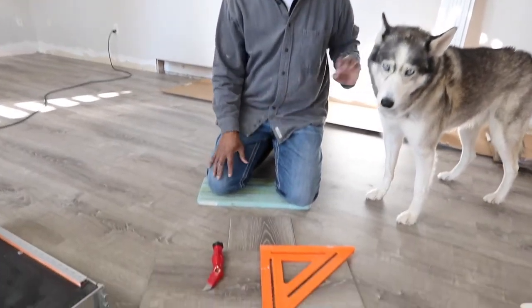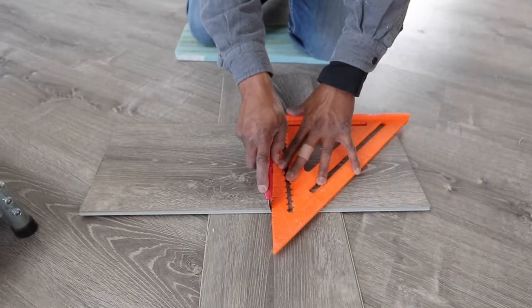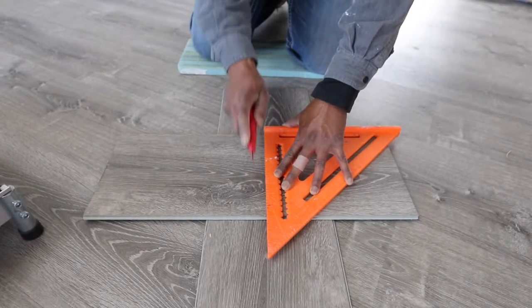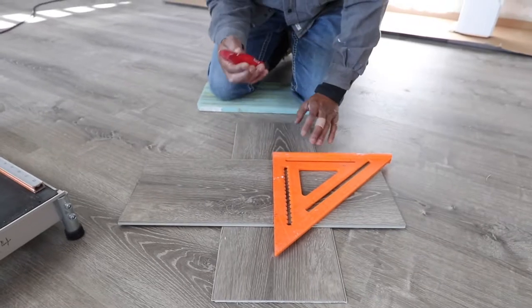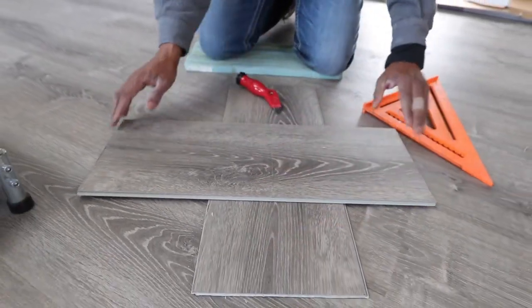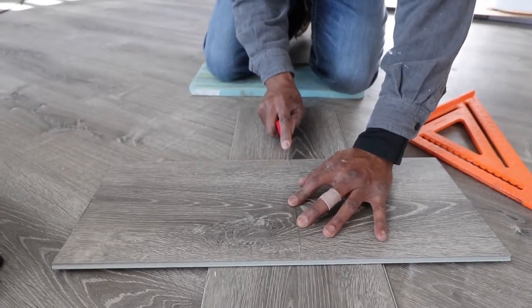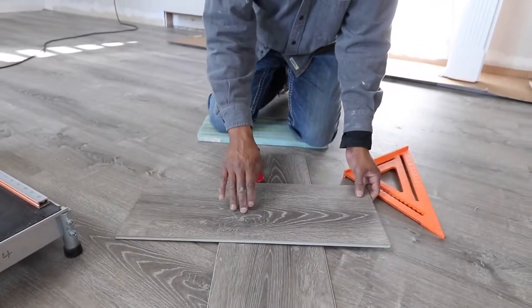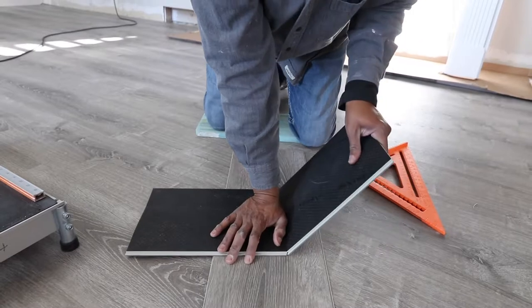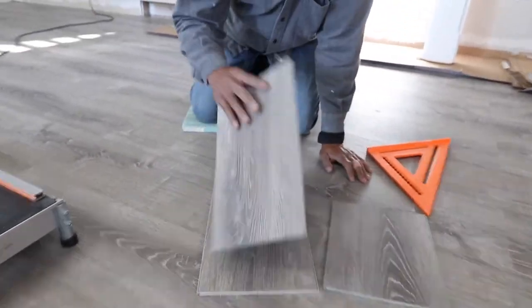There's a hard way and an easy way to cut vinyl plank flooring. The traditional method: use a speed triangle and a knife, score it — you have to be careful because it can move on you and there's always a chance of injury. You've got to do a really good job scoring it, come back down to the end, and then break it. The cheaper the plank, the easier it is, but on this stuff you score it on the back too. For most folks that's probably going to work fine.